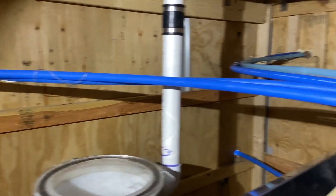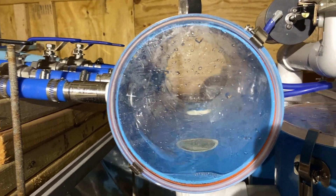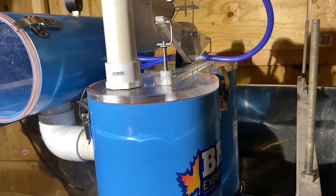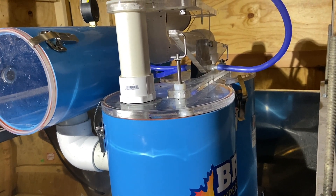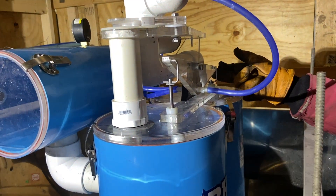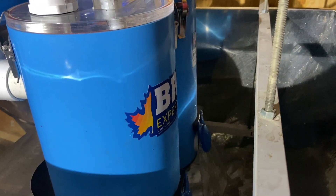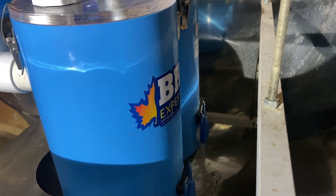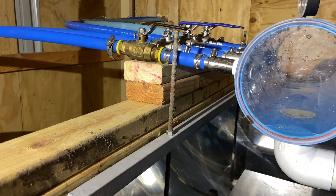So the four lines come in, and you see water flowing there — they go into one of these two tanks here, one at a time. Right now the one on the right is filling up. When it gets full, it has a sensor that toggles and this thing moves over and starts loading up the closed tank. The water goes out of the one that just got full. It's loading sap from the tanks onto a truck.